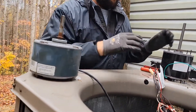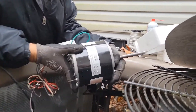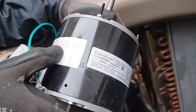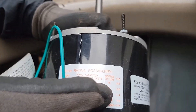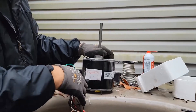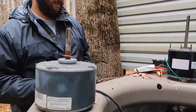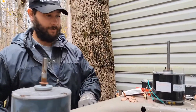This is the motor we're going to replace it with. We can do one-third horsepower with a 5 microfarad capacitor on high speed. So one-third horsepower is what we're going to do. Let's get this motor installed, and hopefully these wires will reach — and if they won't, then we'll figure that out.